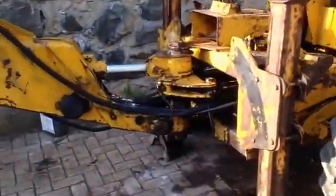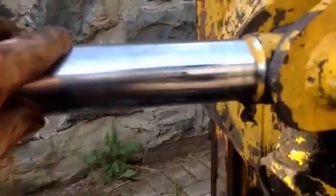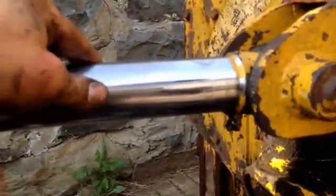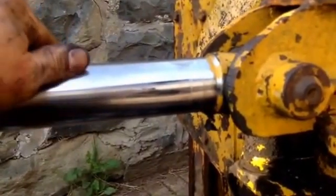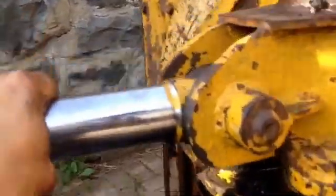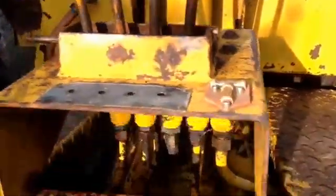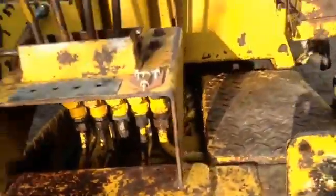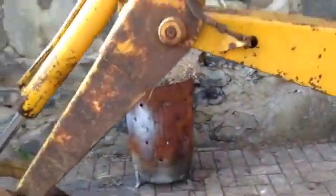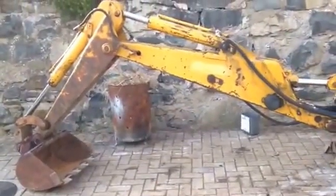The digger comes off. The arm is pretty much as strong as, well, to be honest, look at the size of that. I don't know if you've seen any modern mini diggers, but we're almost up in sort of 3C. Well, not quite 3C, but we're up in, you know, 4 or 5 ton machine size there. 4 lever, annoying, I know, but still. Something quite nice is all the spools are identical, so you can take out the spools and swap them over if there's any problems. Quite a short front dipper, so she's not got much reach to her, but yeah, very, very strong.